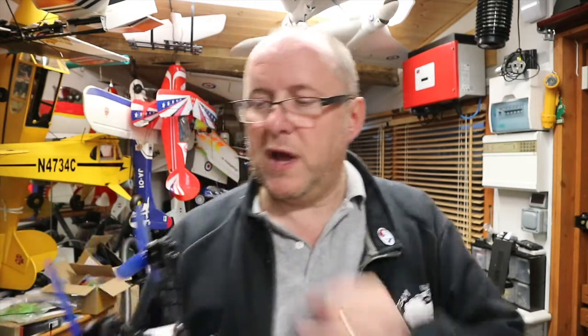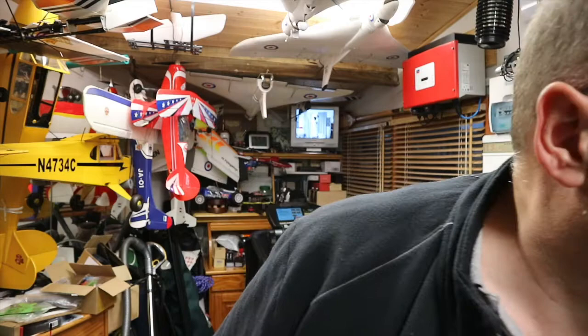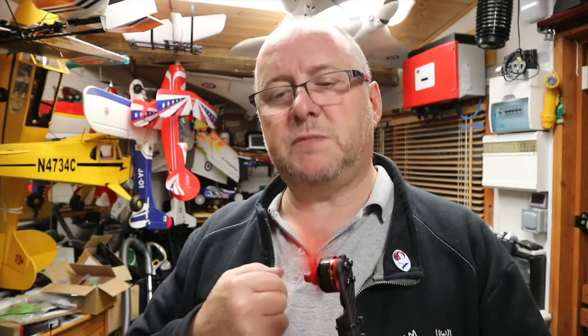Just be aware of that. These are sourced from Banggood - they're a little bit thicker than I would have liked, but they're a nice silicone pad. They will squish out into the center area, and if they squish out there you'll have problems. There's a little C-clip on there that will probably ping off with the silicone binding. So just to make you aware - if they're spinning free, you know you're okay.